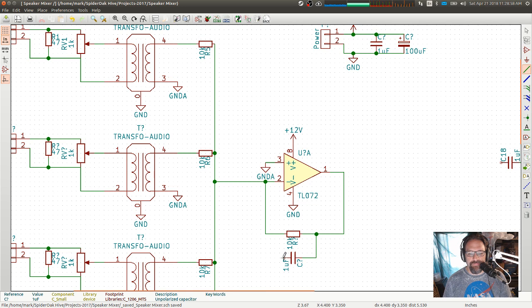So what we do is we put a bypass cap across this resistor, a very, very, very small value cap, so that the audio cannot pass through this cap. The audio still has to go through the resistor, which is where it gets its gain, but all of the high frequencies above audio, all the RF basically, does not go through the resistor. Instead, it goes through the capacitor, and the capacitor ends up being very low impedance for it, which means it has negative gain. So any oscillation that tries to go through there will be dampened. So by having this capacitor here, it will allow audio to go through the resistor and still get gain, still get amplified, but anything above the cutoff, which is defined by those two values, will go through the capacitor and not get any gain.